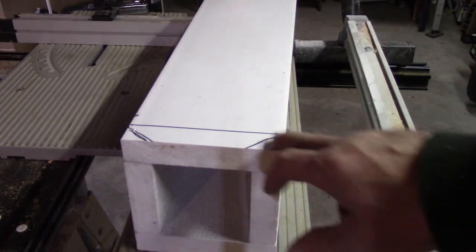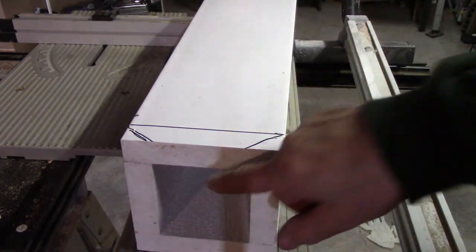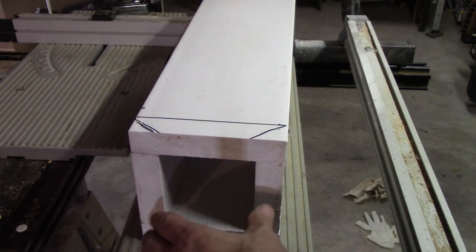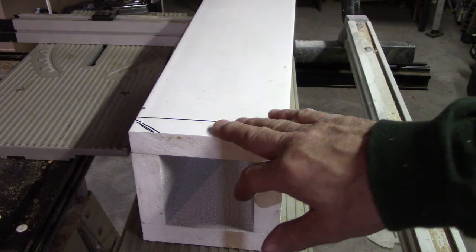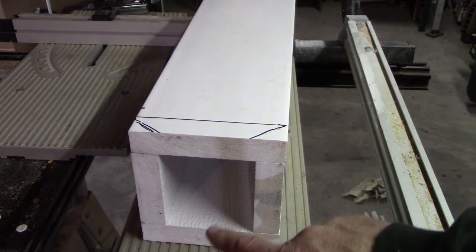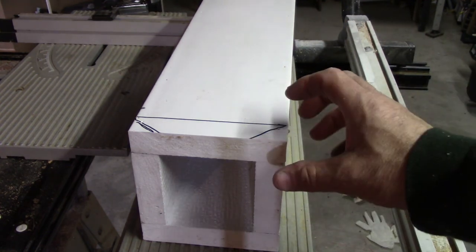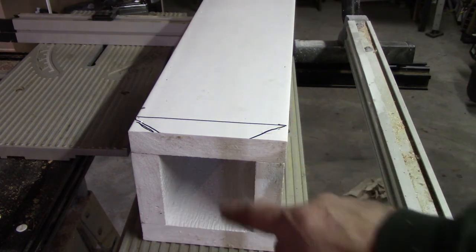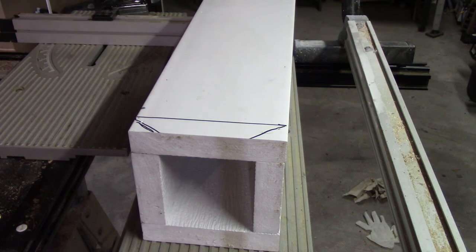Before I try it on the pole, I want to put a 45-degree edge on the bottom of this just to help with the look, because the 3.5-inch sides on a 4x4 pole might look a little too bulky. I was going to round the corners, but since the pole is square I want to keep this square. I just don't like how it'll look with a skinny pole going to a fat box, so I'm going to transition it by cutting a 45 on each leg.